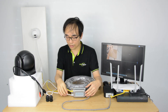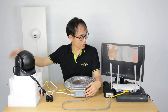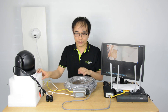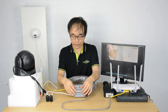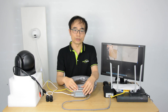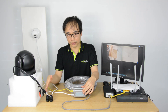It may take a little time for the PTZ camera to get online. Both cameras are now online. One more thing: technically, the new PTZ camera doesn't need to stay close to this camera — it can be 100 meters away from the PoE extender, because the PoE extender also has an extension function which will provide 25W at the end of a 100-meter cable.